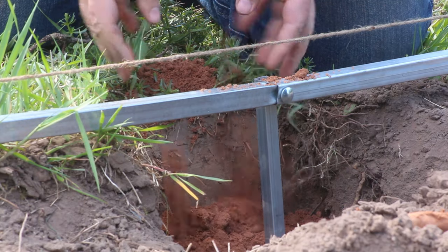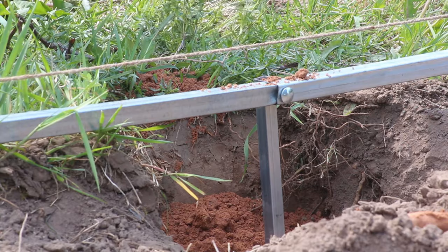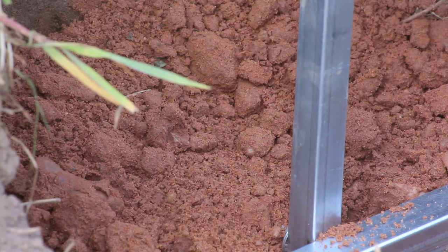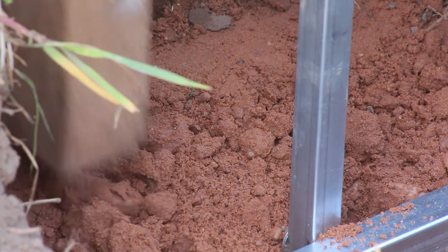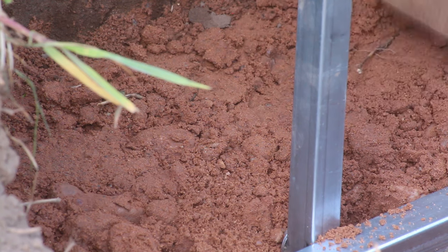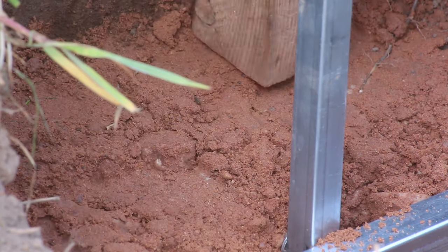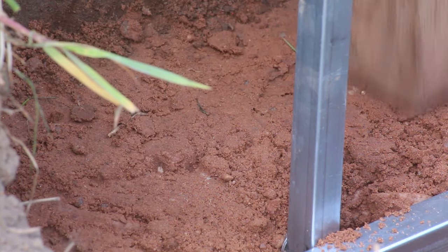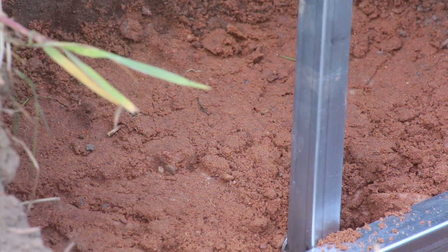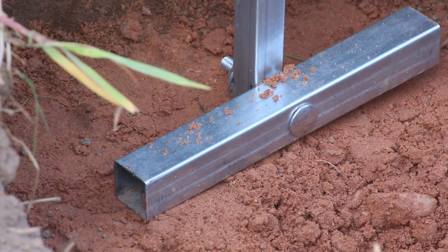For the feet, which you need to dig in, we used a high clay-based sand which we can dig locally in our forest. Tip number two: do not concrete the feet in initially, because you need some flexibility for it to move about when you're actually putting it together. Do put them on a solid base though — the clay aggregate works really well.